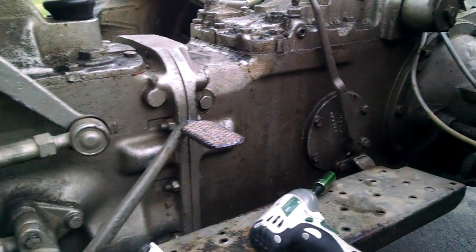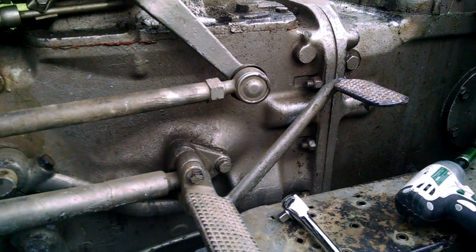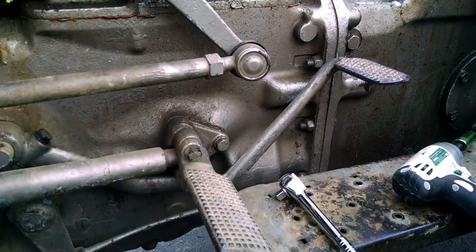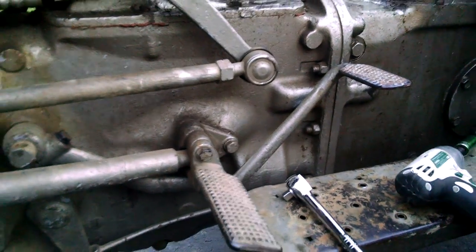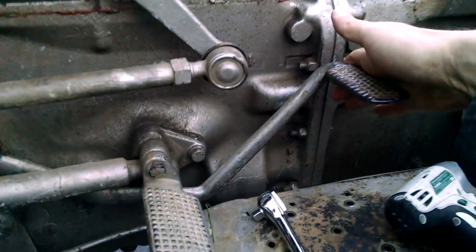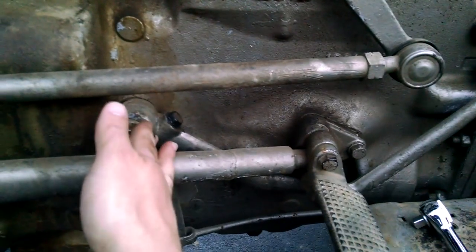This spring, I've been out working and I was doing some cultivating and all of a sudden I pushed down on the clutch and I've got basically no neutral. It's supposed to be a two-stage clutch and there's zero stages in this clutch. I tried doing the normal adjustments — loosen the bolt, turn the shaft forward — and it's just nothing.